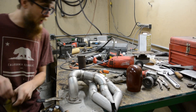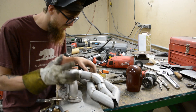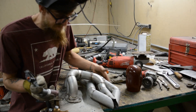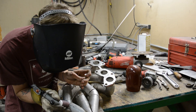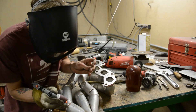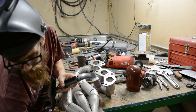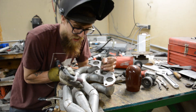First things first, I'm going to drop a couple more tack welds on all the joints just to keep everything as stiff as possible — you can never go with too many tack welds. I've got a 1/16th 308 filler rod. I'll be at 120 amps for these tack welds — running them a little hot is not a bad idea.